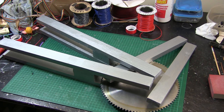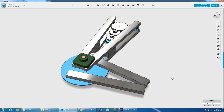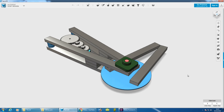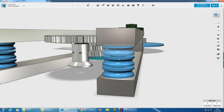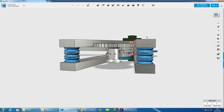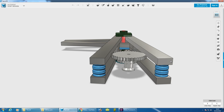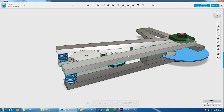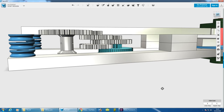So I decided to do a layout in CAD — let's have a look at that. Here's an overview of what we've got so far. The big blue disc is the sprocket with its bearings and studding and the bits of wood. I've got some gears in here and these are the pulleys at the end, mounted on some steel studding that goes through the wood. It could be strengthened up with metal plates top and bottom. In the middle I've decided for now to use spur gears, also printed in Tormant alloy.